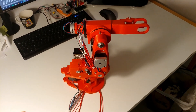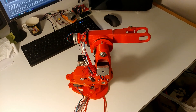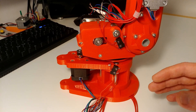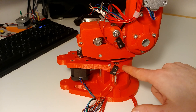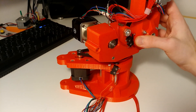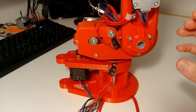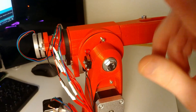We've come off the sketchy studio setup and are back on solid ground. What we've got here is the robot arm — the actual physical one that I printed at A3 size. I've already gone through this arm in SolidWorks and showed its functions, but here I'd like to show a couple of things not on the model or that I've modified afterwards. Something not on the SolidWorks model is this J1 limit switch down here — it's been screwed to the side of the base, and on the 100-tooth pulley rotating the whole arm there's a small cutout with a little lid fastened in with a screw, and that part is what pushes the limit switch. Here's the J2 limit switch, and when the first arm rotates back far enough it hits it. Same thing with the J3 limit switch up here.